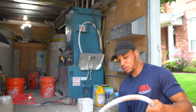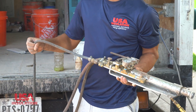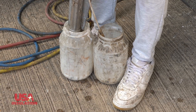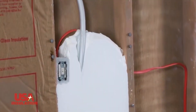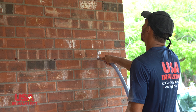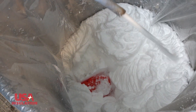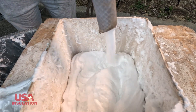This is our standard hose. The standard hose has to be about seven feet long in order to go far enough down into the cavity. You put it together like a Ghostbuster suit and you have a pretty easy day. So you're going to just clear out your lines, and the texture we're looking for is a shiny, warty or bumpy texture like this here.